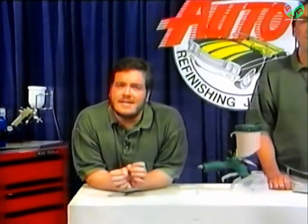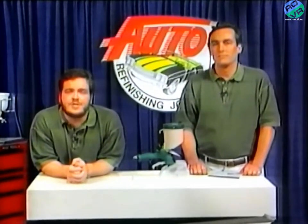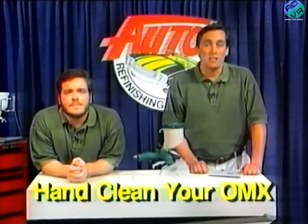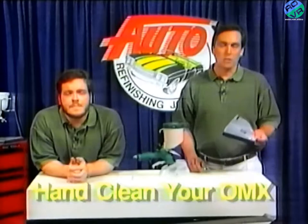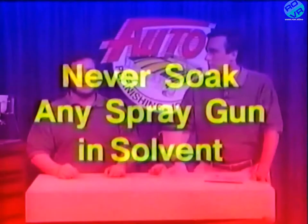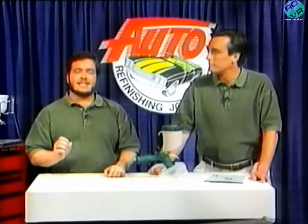That's the basics of using your new OMX, which brings us to what happens after you're done painting — cleaning. Gun washers don't always clean the gun thoroughly; they wash out the lubrication and sometimes even contaminate the gun's fluid and air passages with dirty solvent. Even though the OMX can be used in a gun washer, we agree with DeVilbiss' recommendation to hand-clean the gun. By using the disposable liners, you'll find cleanup is quick and you'll use less solvent. But don't ever soak any spray gun, including the OMX, in solvent — it can cause all sorts of problems inside the gun. You'll also want to keep the gun's spray head attached to protect the needle.